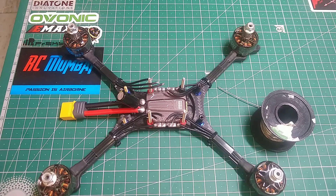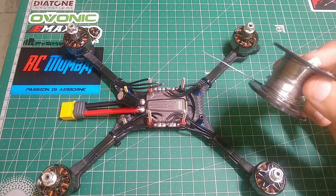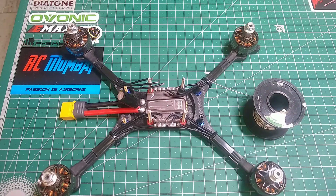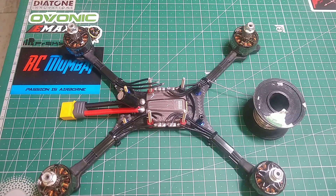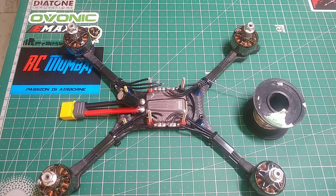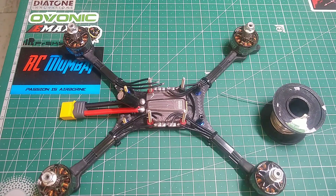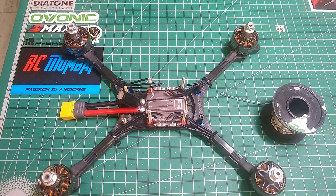That's the temperature at which I work, and if you go above that temperature there is a high chance that you will not get a nice finish. Other than that, you need to use a proper quality soldering wire — don't get the cheap one, get a proper one. They are really nice and they're gonna make your experience much better. Also make sure that the soldering wire is a multi-core soldering wire with a rosin core, as that will help you a lot.